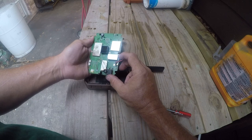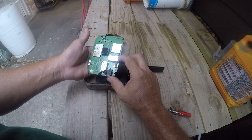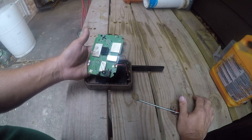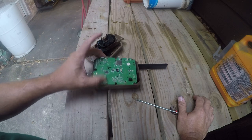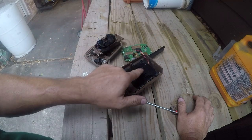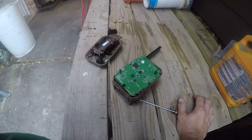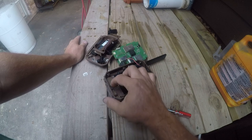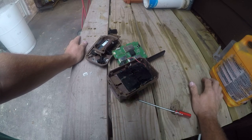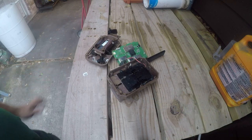They're using a system-on-chip here, so memory is probably built into that. It has an MEID here. These are not waterproof — do not mount it upside down because it will fry. I suspect they're going to wind up with warranty claims because moisture gets in and condenses, and they did not harden the circuit board, which is going to cause it to fail. That is a fatal design flaw. Had they isolated this or gooped it with some rubber sealant or hot snot as we call it, this camera would still be out earning its keep. If you're going to buy an Edge camera or anything else from Moultrie, just understand they cut every corner they can to produce product at this price point.